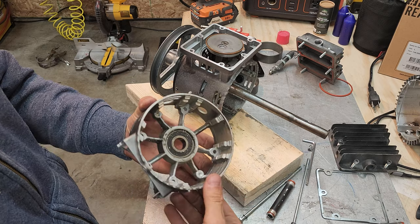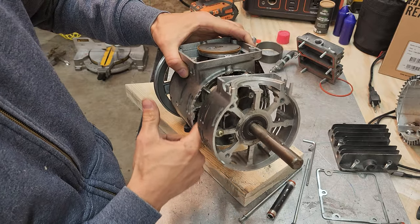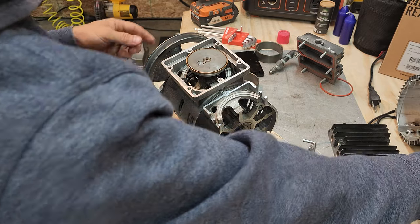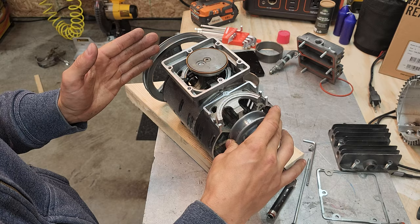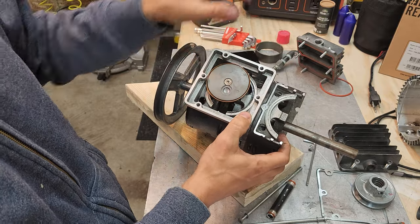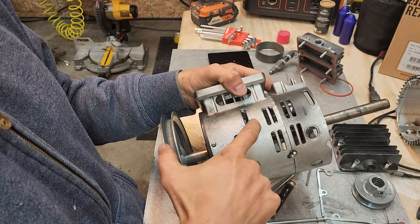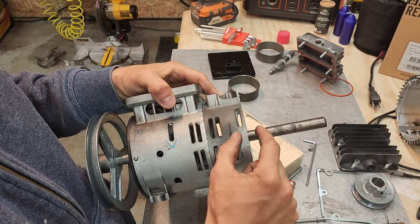Let's go see how this all fits together. This is my factory edge — that's going to be what actually butts up against this. What this gives me is I've got a bearing right here in its original location, and then I've got a bearing over here. This bearing can now support the pulley if I take it off the end here and slide it on over here — I've actually got a more compact unit. It doesn't matter whether you rotate this left or right; it basically just moves the piston up and down. It's the valving in the head that determines which direction the air flows. If I leave this pulley on this end, it's a longer distance — bearing here to the pulley — so there's more bend on the shaft, versus pulley there to there. That's why I would want it on the other end.